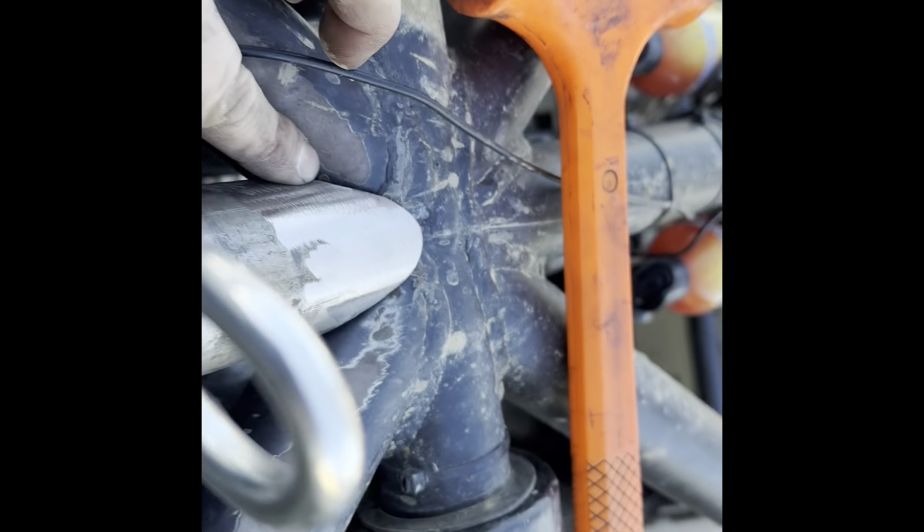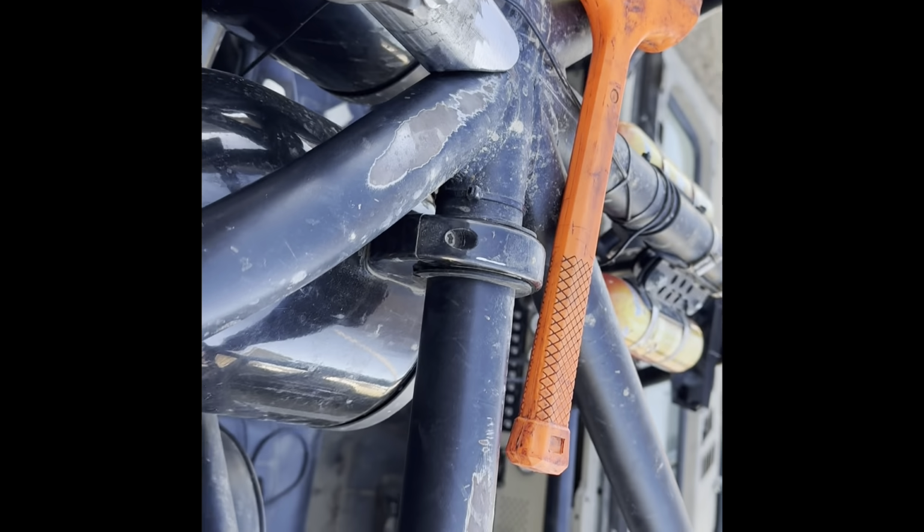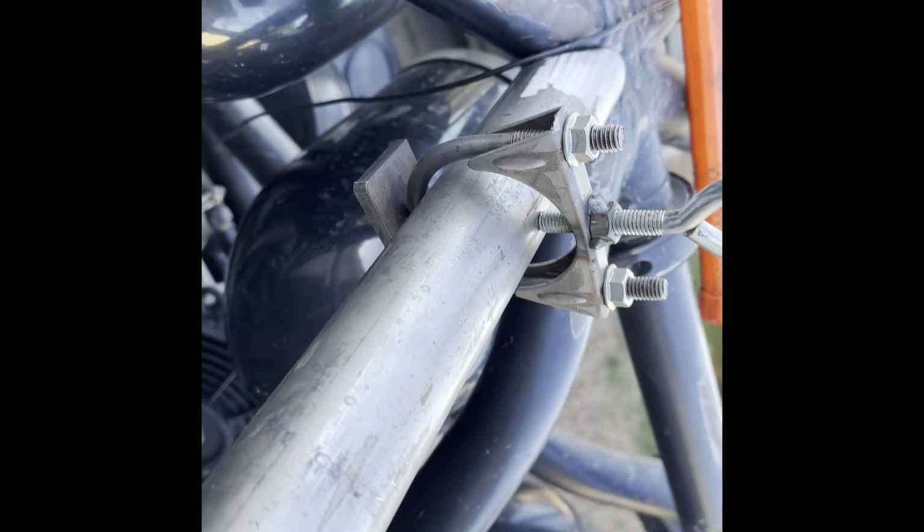What I like to do whenever I'm doing a complex notch, whichever end has more notches to do, I like to do that first. So I got this end done up. I think the fit up's pretty good. I'll do some final grinding on it to make it do what it needs to. So now we're gonna make sure that lines up. Yeah, it's tilted up.